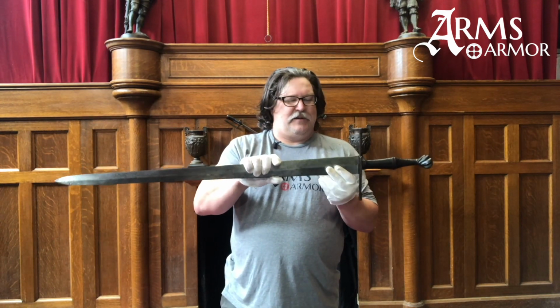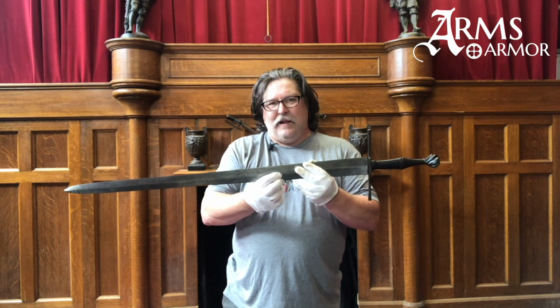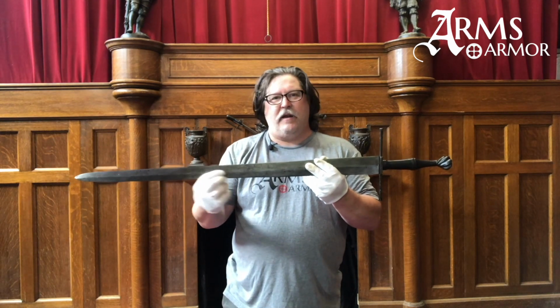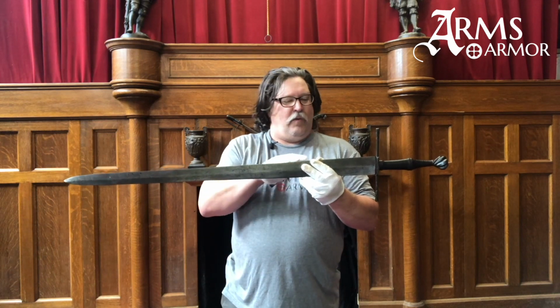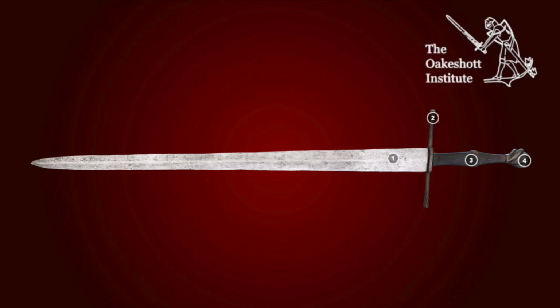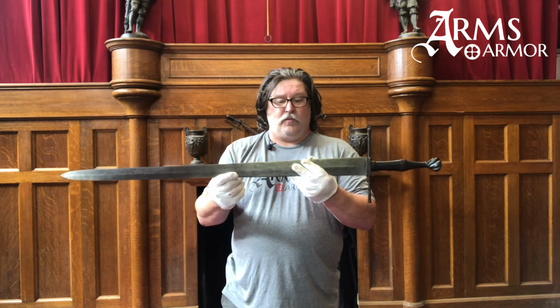It starts out just a little bit under a 1/4 inch thick and travels down relatively evenly, but it does have some plateaus and areas where it kind of varies in the taper. The width, you can see, obviously has a few places of larger wear or more wear on the edge, and that will affect some of this as well.